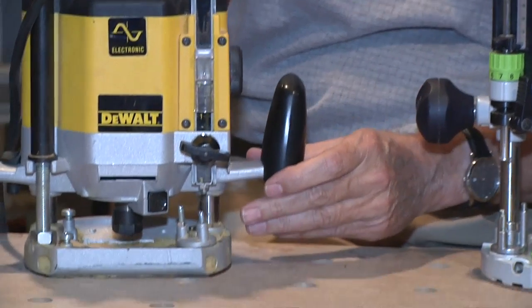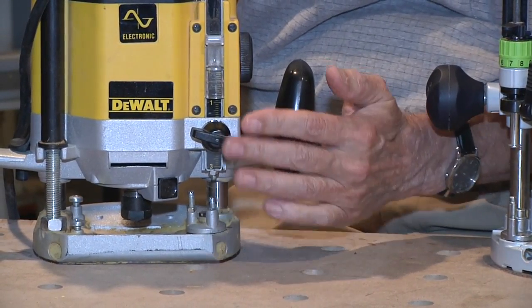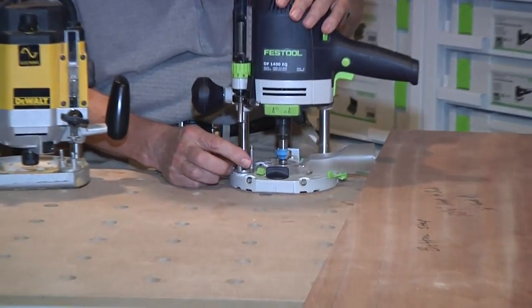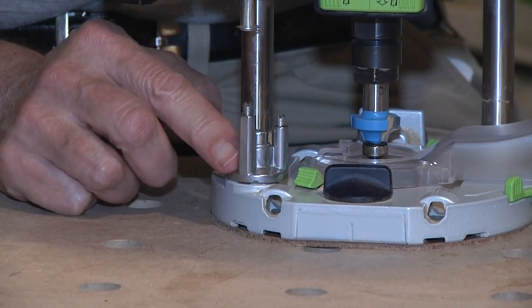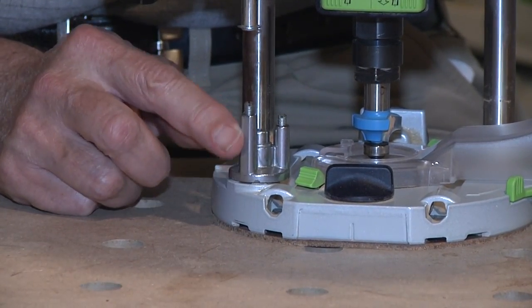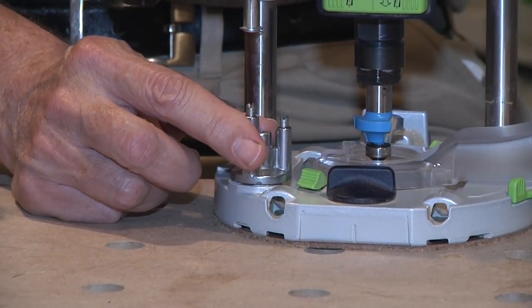On the DeWalt over here, I'm not going to go into it in depth as far as micro adjustment is concerned. As far as the turret principle is concerned, there are 3 heights on the turret, and you really have to look at these carefully because where you have the screw and where the column height is, it's that total effect you're looking for. The tall one, and here you'll see that defined by the column, is the one that's used first for roughing out.